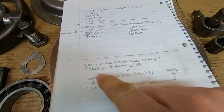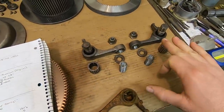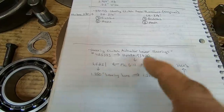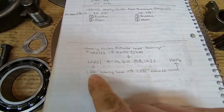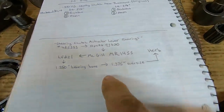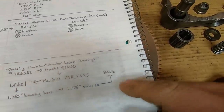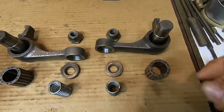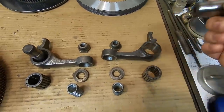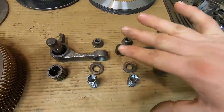Some specs on those bearings: the CAT number was 4B5353. Now if you had to go the bearing route but didn't have any good used, you can use a McGill MR14SS. HFDZL in the comments section supplied me with that data. The only thing he cautioned is the 1.250-inch diameter bore in the actuator lever must be oversized to 1.375 to fit that McGill MR14SS. He signs off as Herb — thanks, buddy. Another option is to just turn out an oil-lite bushing that fits the existing diameter of that actuator and also fits the diameter of the shaft. That's something that on its own will last a long, long time without having to take this stuff back apart.